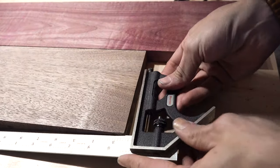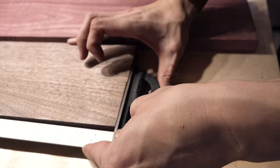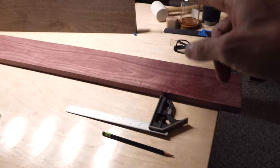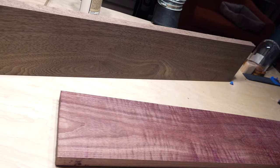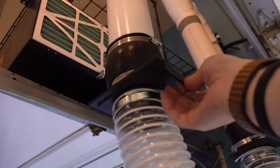Now let's find the straightest side. That one's not straight. Here's hoping that this one's straight so I don't have to recut. There we go, that's the straight side. Okay, that's where we start. Let's find and mark two inches. Look what I just noticed — I'm gonna try to capture it on camera for you. When you get the purple heart wood at a certain angle, it shimmers. It's just so cool looking — see those stripes? Before we do anything, let's check to make sure we're still square. Looking good. Let's open the blast gate.